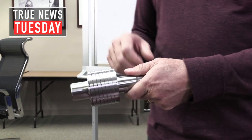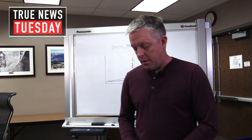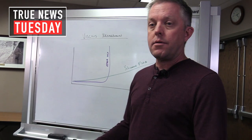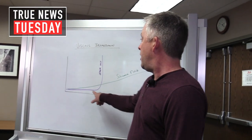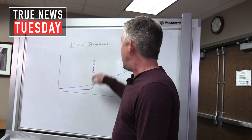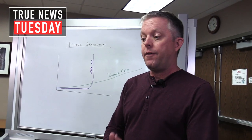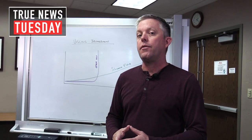A couple of things about the silicone fluid and why we use it: we design and use this fluid because it has a really long breakdown period. With other oils — motor oils or other oils in the industry — the viscous breakdown gets to a break-off point and then declines very rapidly. With our silicone fluid it's a very gradual, extended life, which is very important in the field so that you're not suddenly surprised with a tool that's running at triple or quadruple the speed of rotation.